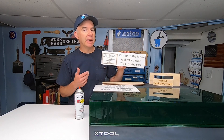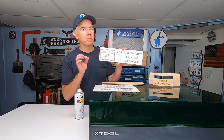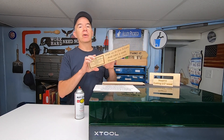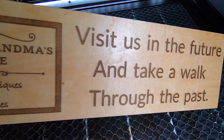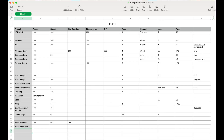You can also try spray painting your project before you engrave, like I did on this sign. It came out better — there was a little bit of burning, some of that wiped off, but I could still see just a little bit. The best thing that I found was to spray it with a clear acrylic first, and then engrave. There was a slight residue which just wiped off, and this sign came out perfect. This is why I say these machines are fiddly — you have to fiddle around with the laser settings to dial them in just right. It is a good idea to make your own spreadsheet and keep track of the settings that you use for each machine and each piece of material.